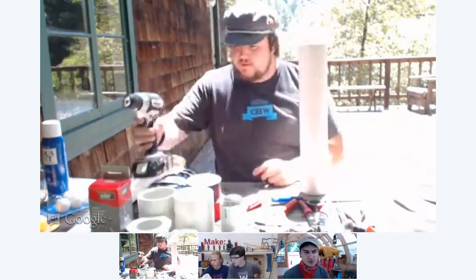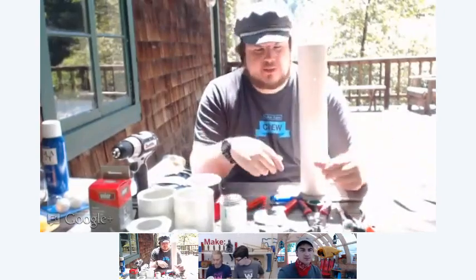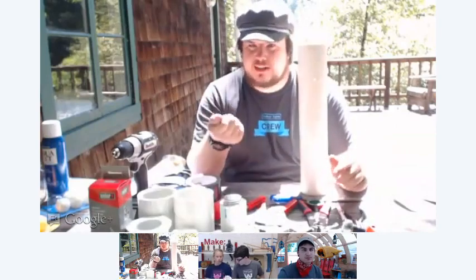And so what are those holes for, Dan? These are the holes for your electrodes. So we're not actually going to use a tap to thread the holes. We're just going to use the screw. Okay. The screw is harder than the plastic. So the 1/8 hole I found is just about the right size for it to thread itself.